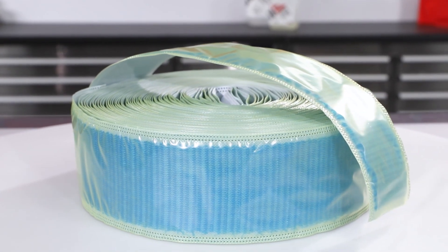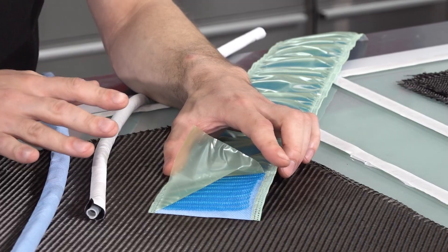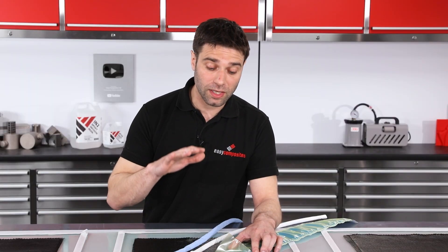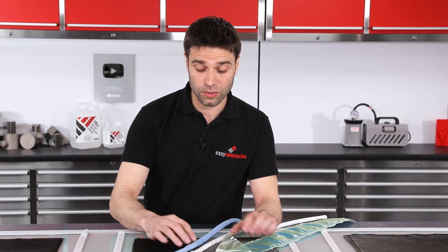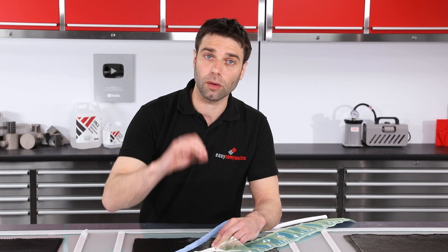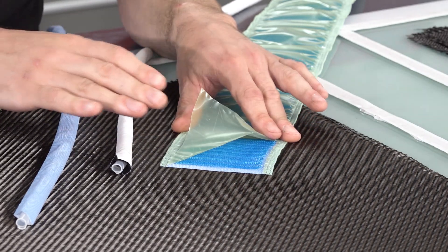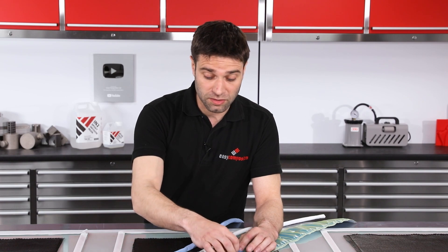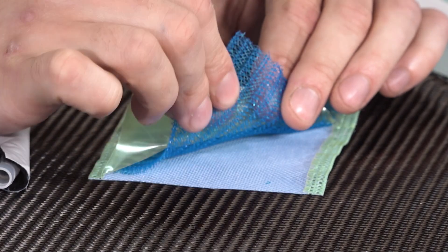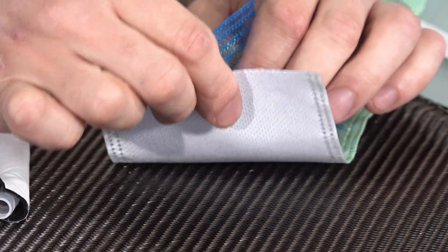Finally, we have the MVS strip. In terms of functionality, it does exactly the same job as the two lines but it's in a flat format. Where this is useful is if you need to maintain a vacuum into the center of a part — the flat format won't print onto the surface. If we were to use a hose format product, the bag would bridge over the top and leave an impression on the part. The flat format versions don't do that, so they're ideal for any times when you want to maintain a vacuum in the center of a part, such as an outside-in infusion. We have a mesh here that maintains the air channel instead of the spiral, a layer of impervious film on the back, and then the microporous membrane on the bottom.